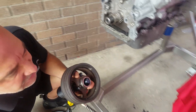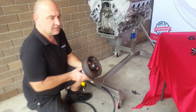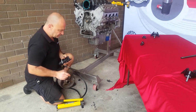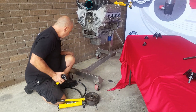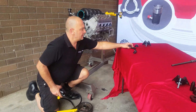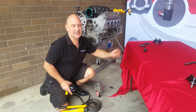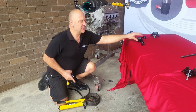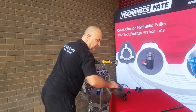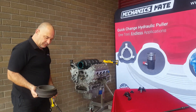That's it — she's off. So that's how long it will take with this kit. As you can see, we had to do it three times. We just missed out in length with the shorter spacer and again just missed out with the second spacer. It depends on the engine and a lot of things. Using the other three-jaw, we'd generally get it off in two bites.